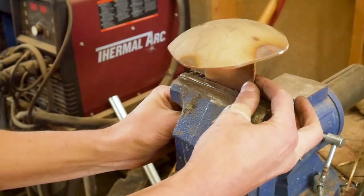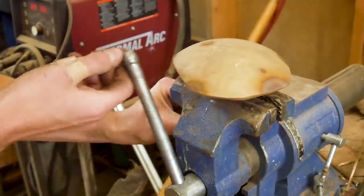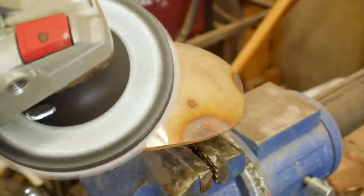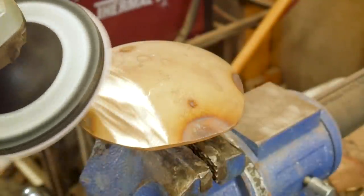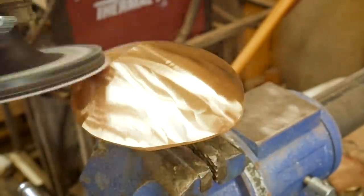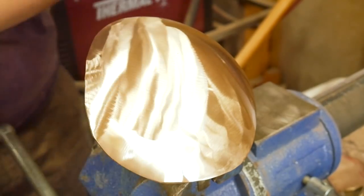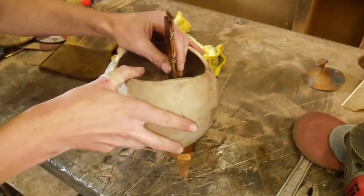In line with the prep work, this balloon is going to end up mirror polished. The polishing process is a progressive set of steps of increasing grit sandpaper on a grinder. While I have the window out, I'll perform a few of the progressive sanding grits just to get them out of the way now while this piece is easy to manage. I'll start with 80 grit and move up to 120 and then 220 grit. These lower grits are important to be patient with because you can introduce grooves or warbles into the shape of the metal, which will show up in the surface of the polish later on. The large window is ready to be set aside; most of the prep work has been completed.